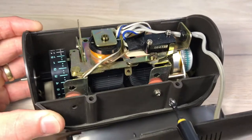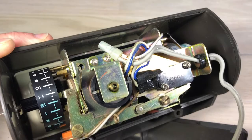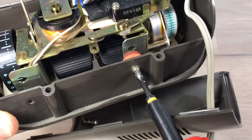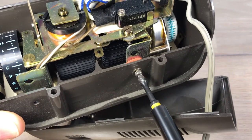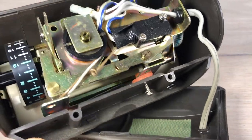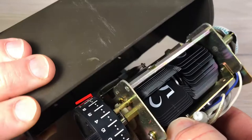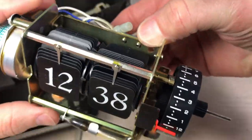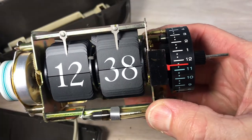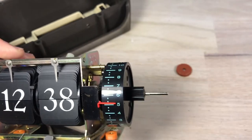What I want you to see is right there on the clock mechanism there's a nut. That washer just dropped away — I've already taken that screw out. That nut on the clock mechanism, if you do this improperly it's going to break loose and make it really hard to get the clock back together. So what I'm unscrewing here — I'm not pushing down on the screw real hard, because that will pop that nut out. As you start to unscrew, take the pressure off. Much easier to get the clock back together later. You can see the motor's turning; nothing major out of order there.